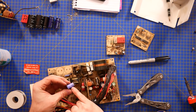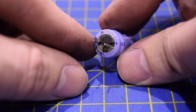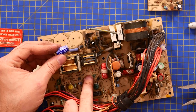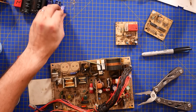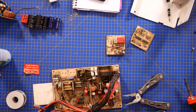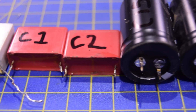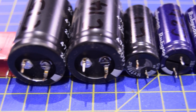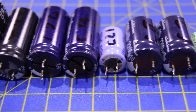Just working my way through all the capacitors, and I finally found one that's looking a bit suspect. It's slightly bulging on the bottom — 470 microfarad 25 volt — and you can see it's just starting to leak a tiny bit onto the board down here. So maybe we found our candidate. Like I said, I'm not worried, we'll replace the whole lot anyway, but it's looking promising. I've taken off a nice big array of caps now, and three or four of them are looking very suspect. But just to be safe, I'm going to replace the whole lot, and hopefully that'll make something work.